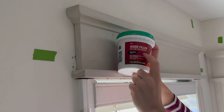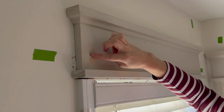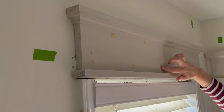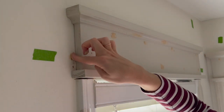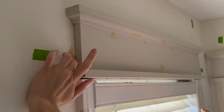I'm using my favorite wood filler by Ace. Once these are dry, I sanded them with 220 grit and did just a little bit of touch-up paint over the filled areas. I'm also taking this opportunity to fill in the hardware holes left from previously hung curtain rods.